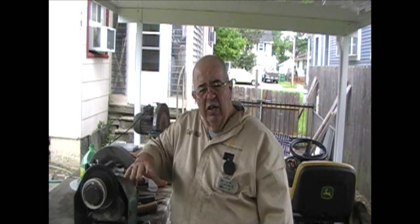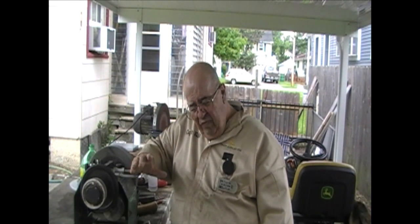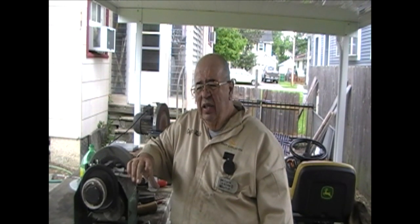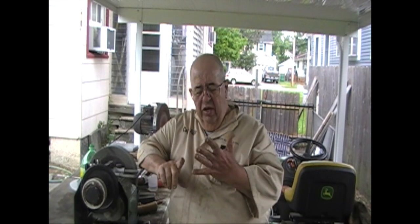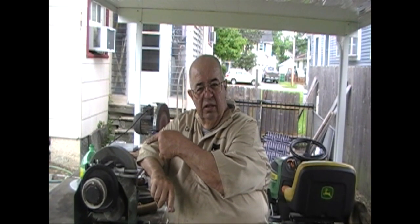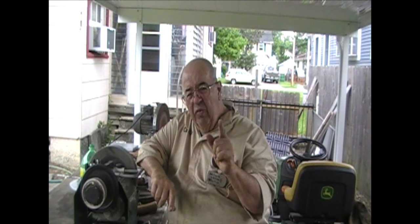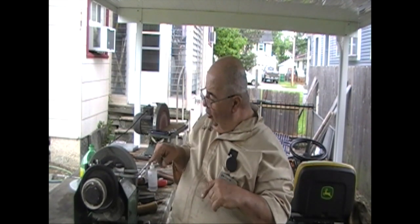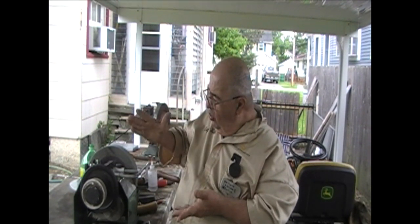And I turn it using conventional grinders and my CBN wheels. Okay, the difference is one grinds away, one cuts away, one polishes. If you're doing carving, detailing, scalloping work and all, you need this. You really do. To get them that sharp all the time and consistent, and you'll learn how to build a jig to know how far to put this in, how far to mount it in the guide.